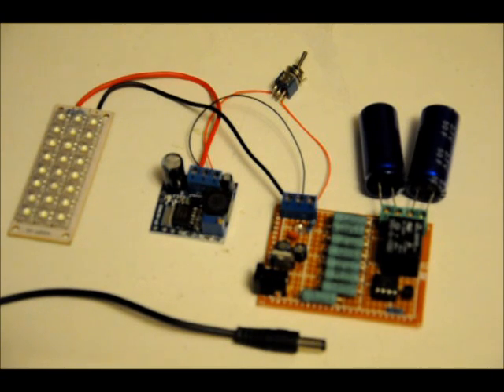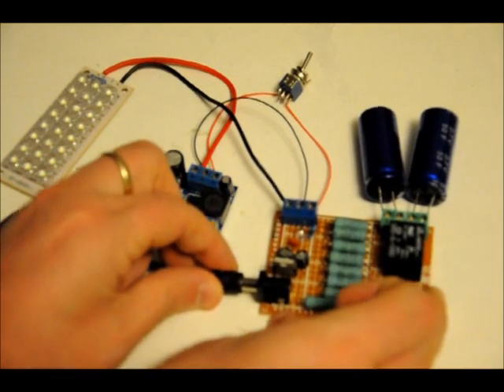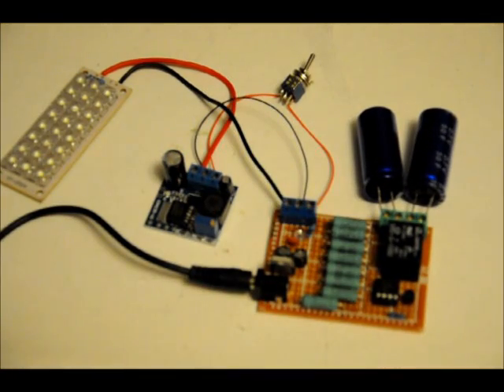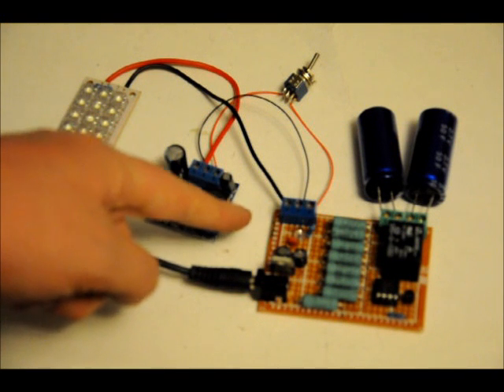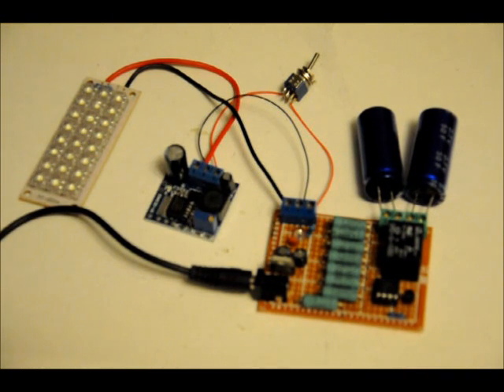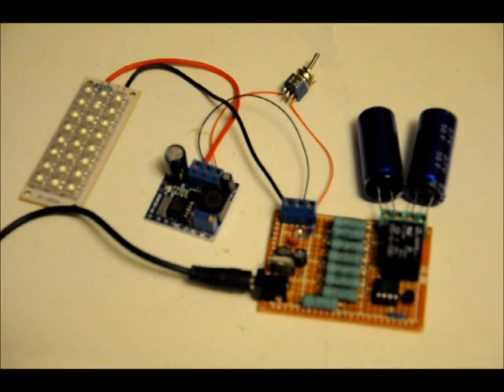So what I'll do is plug it in and show you piece by piece. I'm not sure if you heard it — the relay just turned on. The green LED blinked three times, and so now we're just waiting. If I probe the capacitors I'll see the voltage slowly charge. Through the resistor bank, I've got about 500 milliamps charging the capacitors right now.